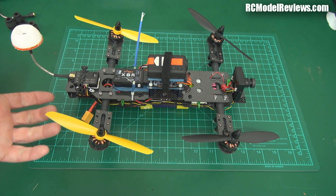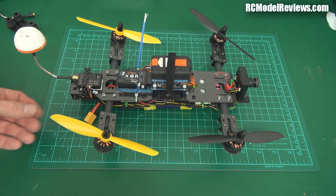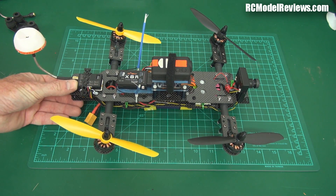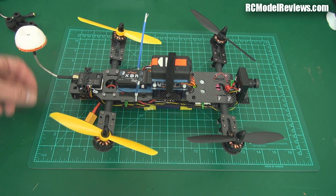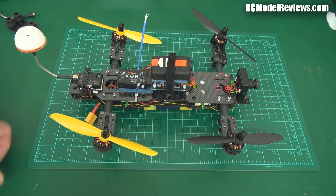Sometimes on a long run you've got to use coax to get rid of that noise, because twisted wire just won't do it. We'll try it out and see how we go. I'll give you some examples later on in another video showing how to deal with those last little bits of annoying lines. At the back end here we've got the Skyzone 500 milliwatt transmitter — quite a small transmitter in a metal case — 5.8 gigahertz of course, running into a homemade cloverleaf or skew-planar antenna with a ping pong ball cover on it so it doesn't get bent.